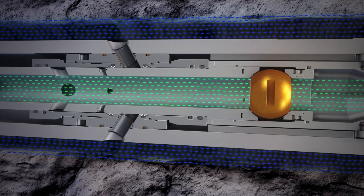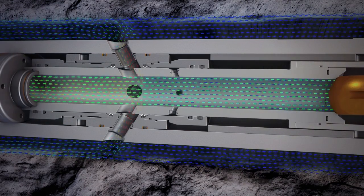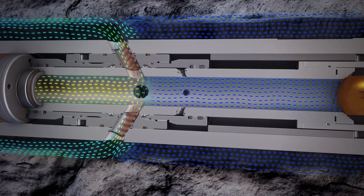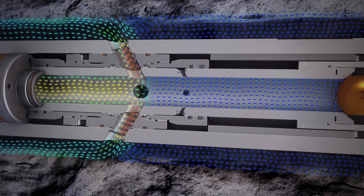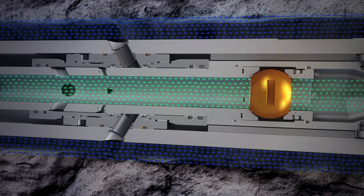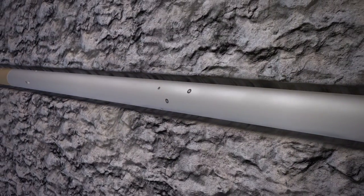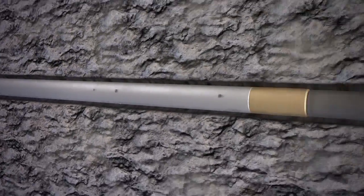Full bypass for rapid wellbore cleanup through the large TFA of 4 square inches for the 8-inch tool. The bypass position can also be used to deploy any form of LCM up to 150 pounds per barrel. There is a full bore closure to ensure no LCM material can pass into your MWD or bit nozzles.